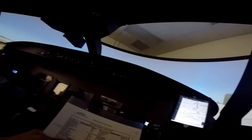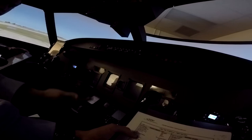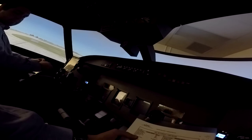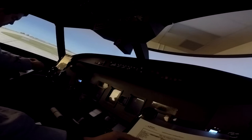Landing gear lever is down. Spoiler level zero. Flap set. Actual position. Yeah, so the actual position. We talked about that, right? In case they were out there while he's doing his walk around and they're actually deployed a little bit. It happens sometimes when people are shutting off the aircraft. They'll forget to put that down, but as they're turning it off, they'll do the hydraulics, whatever. They'll leave them in there, or even while they're still coming up, they'll be locked at like 6 degrees or something like that. So you don't want them moving.